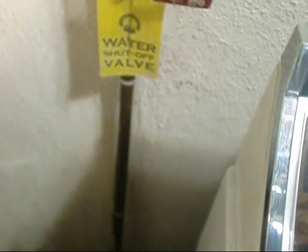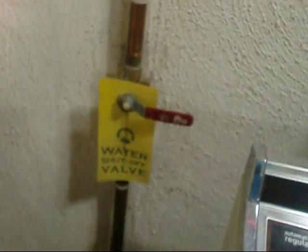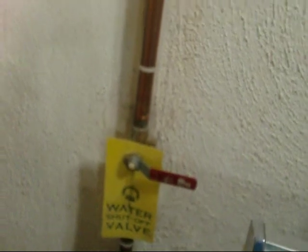Well, over time those gate valves give out. They're no good. So instead of even messing with that, you'd be in a world of hurt messing around down there. What I did was I cut that out, and I put me a ball valve right there. So now I've isolated, everything's turned off, and I'm getting ready to make my cut.